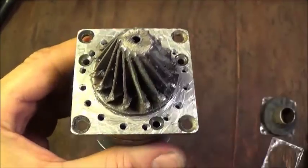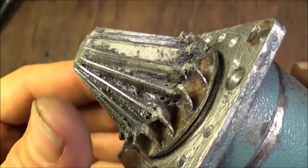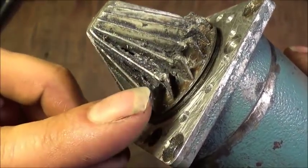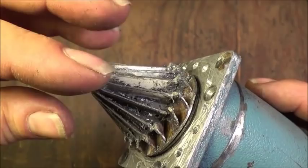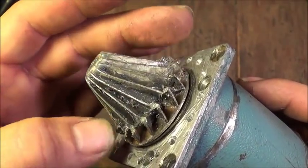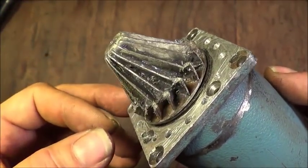Let me remove that and take a look at the compressor head itself. You'll see what I've been able to do to build that — there's a lower fan blade here that's the second stage of the compressor, and you've got your larger conical blade design that's going to grab and really force a lot of that air into the system, and then these smaller blades are going to force it under pressure into your diffuser. That is our compressor head.